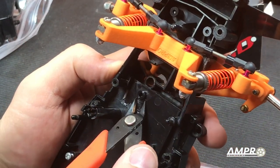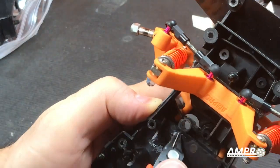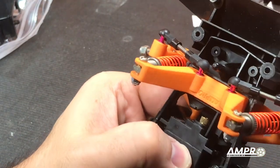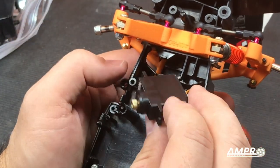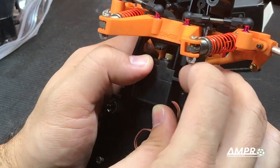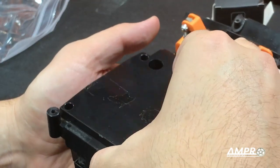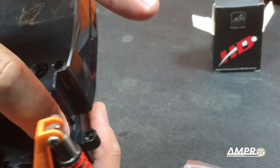We'll cut this off. I want to keep this post here because this is where the original LED sat, and I'm hoping I can wire something in to make all that operational still. We'll cut this one off as well using flush cutters. And now we can drop that in. That is absolutely fantastic — this could not be better. This fits right there. I will use a pad of VHB — Very High Bond double-sided tape — and that'll be held in there permanently. I think that is going to be perfect. Let's just confirm the lid still fits. That looks great.